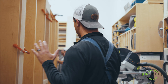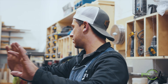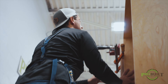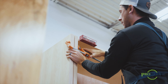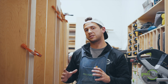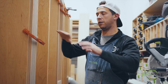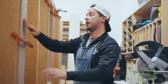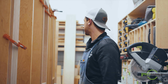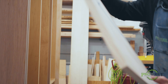Coming down now — this side is all the lobby side. The initial design that Campion had drawn up was basically just a dead flat panel wall back here. We've decided to maximize storage and do full eight-foot panel doors here with very shallow shelving. Directly where I'm standing sits a stanchion in the existing building, so we've built a filler panel that will just kind of fade away in our reveals and flat panel door detail, but this will allow full functionality of these four doors. So we make our way back to the visual portal — here's our door detail: MDF core edge banded with white oak.